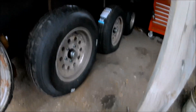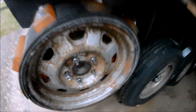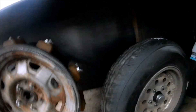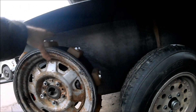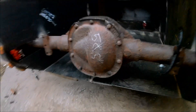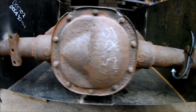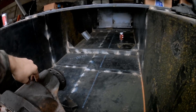It just started raining so I moved everything inside — got a bunch of crap on the tractor just to keep it nice and dry under one roof. Rolling chassis, all wheels lubed up, bolted up, ready to go — still need a little more air in the tires. Got the differential tack welded to the frame. You can see the large height difference between the drive sprocket and the leading road wheel; it'll be interesting to see how the track droops over that. The reason I did it that way was to get enough clearance from the bottom of the tub to the bottom of the pumpkin so it's still easily serviceable when you need to drain fluids. Plus, I flipped it upside down because it's going to be a rear-engine drive.